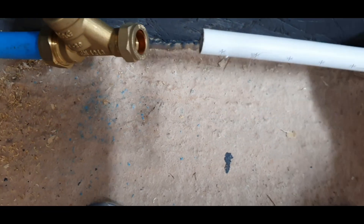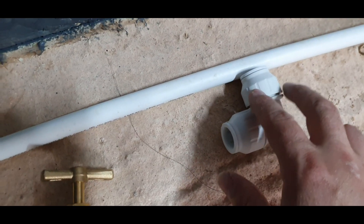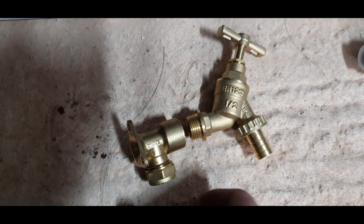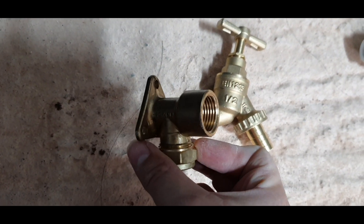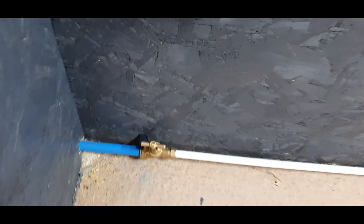The next step is to add the 15mm pipe onto the other side of the stopcock. I'm going to cut it in half and use a 90-degree bend to put the pipe going upwards to where I want the final tap position — this is a push-fit fitting. The tap itself is two parts: one part mounts to the wall and then it screws in, and then we have a tap fitting to use. I've put a little bracket down here to just hold that tap in place. I'll probably put another couple of brackets in to hold the 15mm pipe. I have tested it — it does actually work!